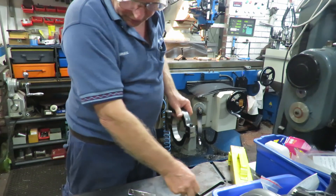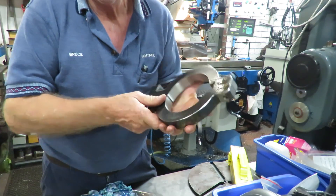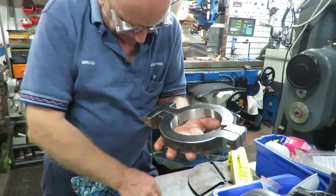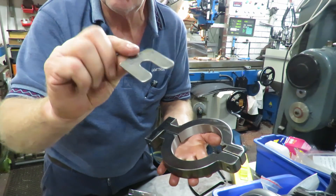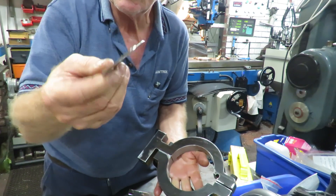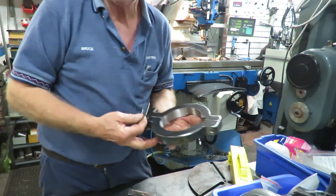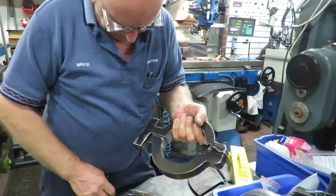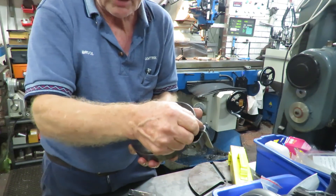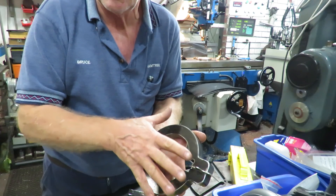So what I did was I stopped the machining, made sure one half was clamped well down, put an extra strap clamp in, released the bolts, and introduced two 2mm shims — that was the maximum I could use. I have a big box of these shims. I put those two shims in, closed it up, and moved the X table 1mm forward — since the shims are 2mm, moving 1mm forward — and then proceeded to do what we've seen done now.